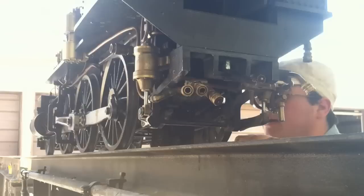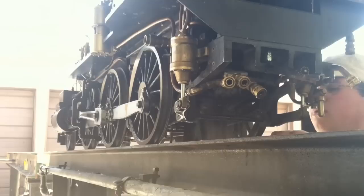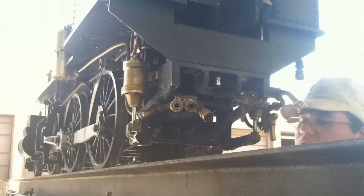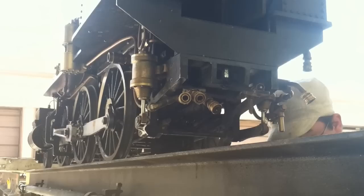Keep the engine going as you clean out your ash pan — I recommend you do that every time before you operate, not at the end of your run. Too much ash in the ash pan can actually cause your grates to warp and require replacement. Although it's not a very expensive or hard fix, it's a nuisance and good to avoid. It does make a mess, so you don't want too many people around — especially if they don't like getting dirty. If they don't like getting dirty, they shouldn't be around steam engines anyway.